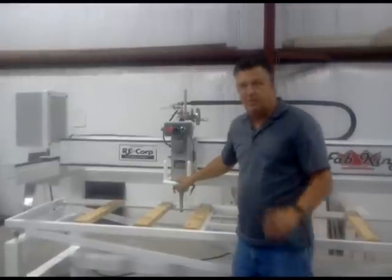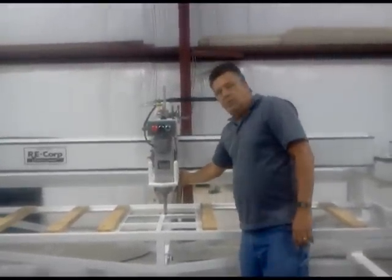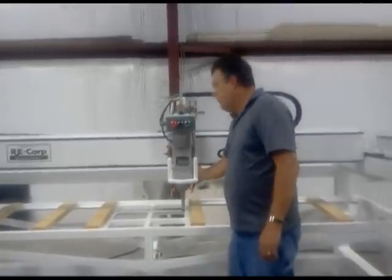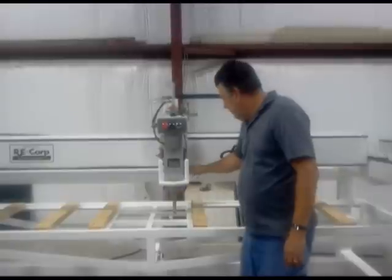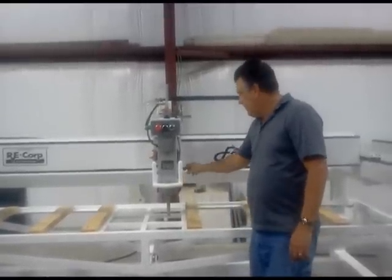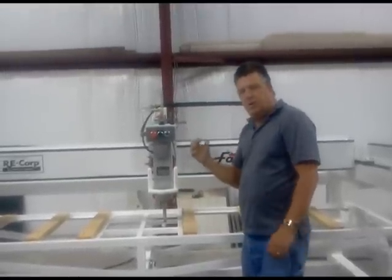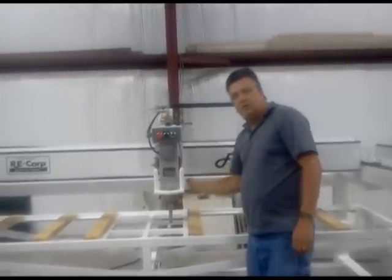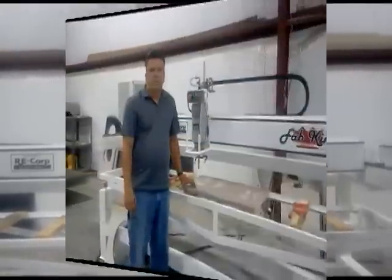The only adjustment on the machine are the bottom roller wheels on the travel. These wheels are eccentric. They are adjustable by turning the flats on the adjusters, loosen the 9/16 bolt. You can literally adjust the cam rollers to be tighter against the bottom rail. Literally, that's the only adjustment on this machine.